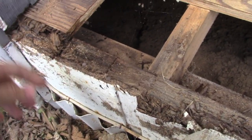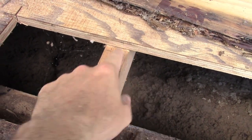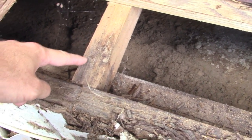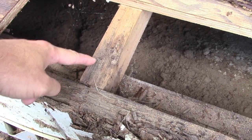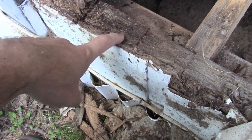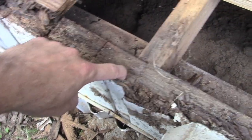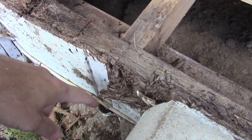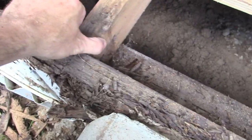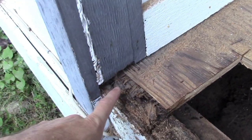As you can see, we've run into some pretty serious rot here. Here's the piece we cut out — we cut back about 9 inches, and we've got some solid wood back 9 inches. Here is our tapered joist for the front porch. Right here you can see the beam, the exterior beam. I don't know if there's any rot in that, but you can see this cap piece on the end. The siding here is all rotted out as well, so that's going to have to all be replaced. Luckily, our beam is down further — it's pretty solid.